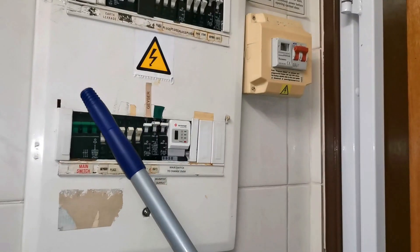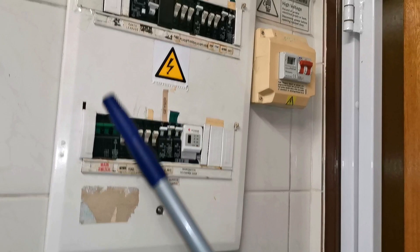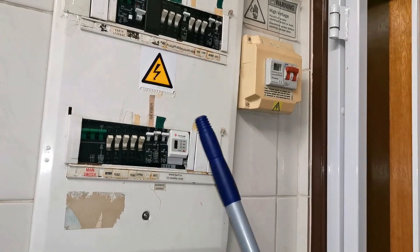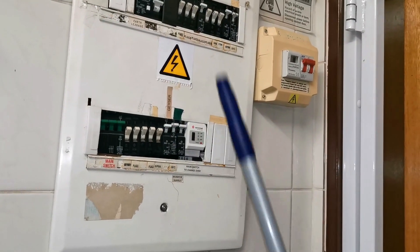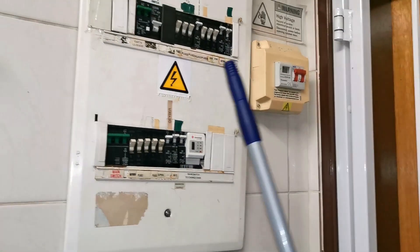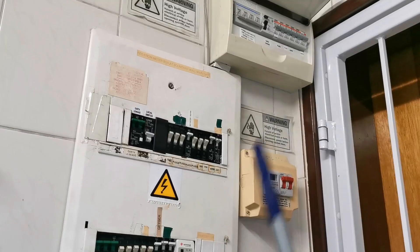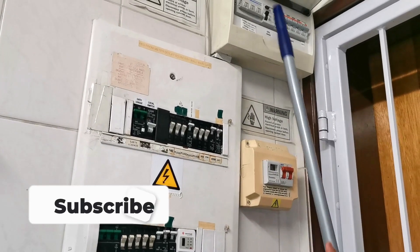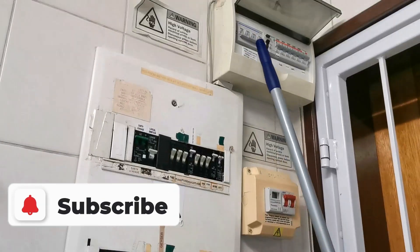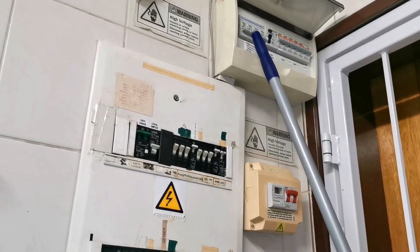It's a special cable because it has specialized shielding built into it, so with a NOS cable you don't need to run it within a conduit - so this is compliant as it stands. This four-millimeter NOS cable in gray is supplying utility power to the inverter, and this is the GoodWe meter. If I open up the DB here, this meter is clamped to my main power feed, and that is how the inverter determines whether it's exporting, consuming, or blending utility power with solar.